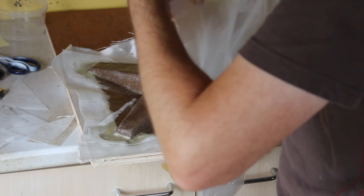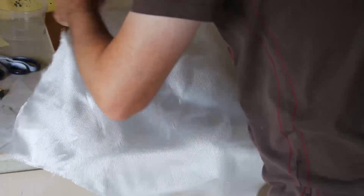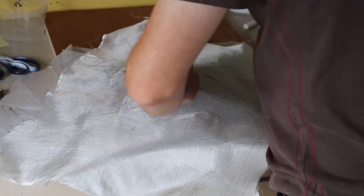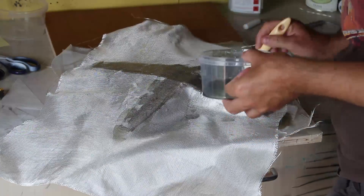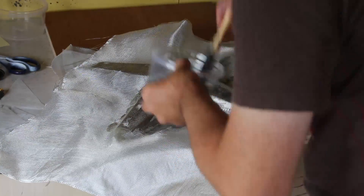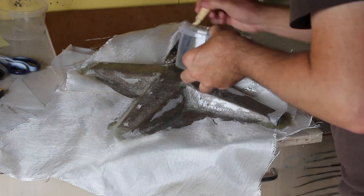We're now on the second bit of cloth, and I've put this with the fibres going in the opposite direction to the original. I don't know if that will really make a difference here, but it's always worth crossing the fibres at 45 degrees. The cardboard is holding up, which is always useful — I didn't know if it was going to collapse under the wetting of the fiberglass resin, but it's sticking.